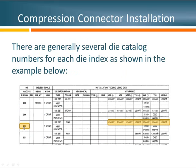Back to the die index concept — here's an example of the chart. Here's our index 300, and if you follow this row through the chart, you'll see several different catalog numbers of dies that are all in the family of die index 300. These different die catalog numbers are used in different tools. The key thing to keep in mind is that these dies are not necessarily the same width. More powerful tools can go with dies that are thicker and use fewer crimps, while less powerful tools need narrower dies and more crimps. Always refer to the manufacturer's installation instructions to get the proper number of crimps for the die you're using.